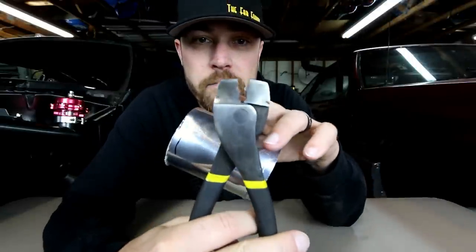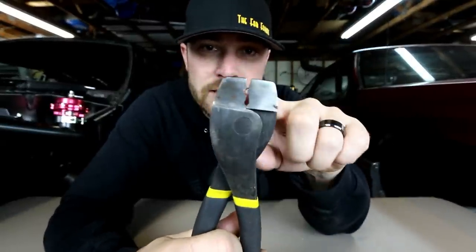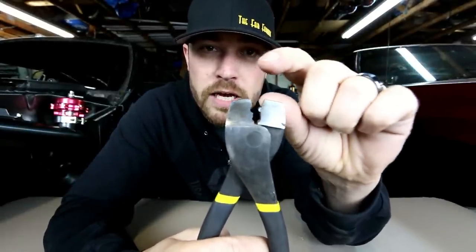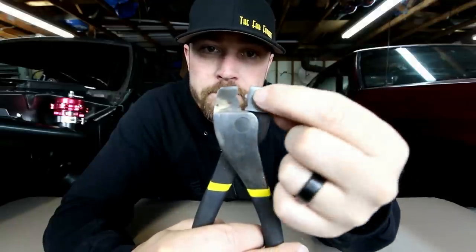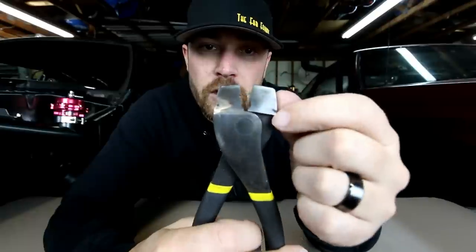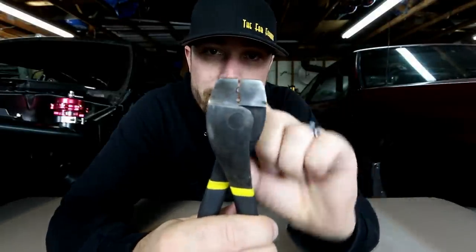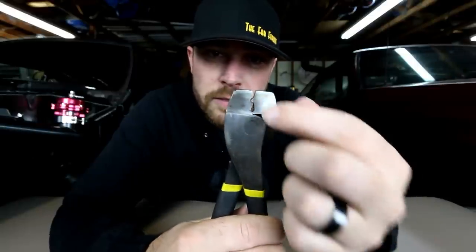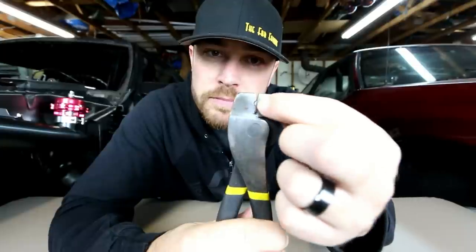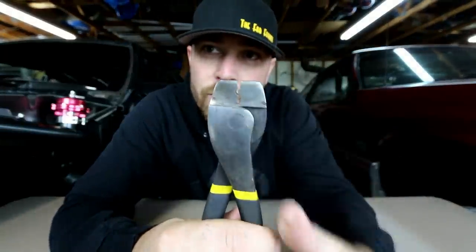Just take this thing — if you look right there, it's basically the crimping section of your nippers. This top piece would be the normal part that would cut the wire, and this piece in the center here is what you use to crimp your connectors. All I've done is I've cut the top off and then just clearanced this thing just a little bit to give it a little bit of room for the aluminum to fit in there. If it's, I don't know, 40 thousandths aluminum or something, that's what you want to be able to fit in there. And hopefully you can see there's a little bit of light showing right through that hole right there.